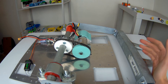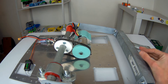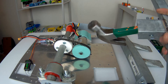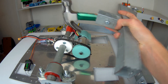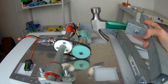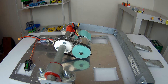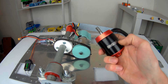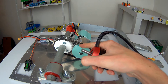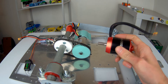This is a sportsman class — you're supposed to have an active weapon that you know is going to work — so we're going to have to pivot and use something I kind of built as a bit of a joke for Strange Young Man last year, and that is the hammer module. This is literally a hammer in some box section, which this motor would be able to throw around. However, this motor is now way too slow for what we want, because we want this hammer to swing faster than we wanted the lifting arms to swing, so we're going to change the motor and giant gearbox combo over to a very slow 140kV brushless motor.